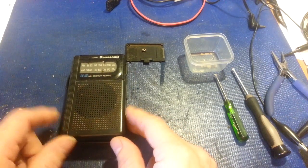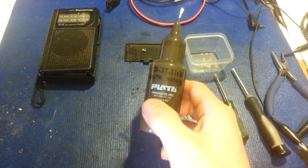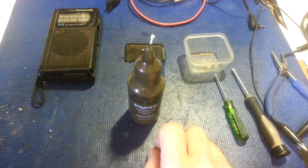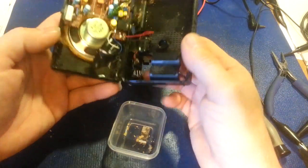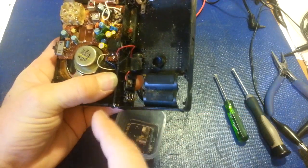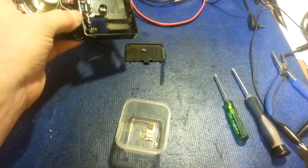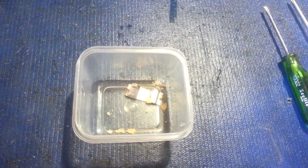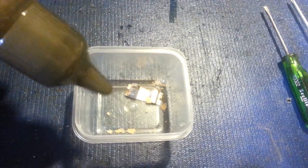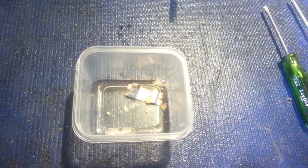Most kitchens are going to have vinegar. I use distilled white vinegar — I keep it in these little bottles as my bench bottle, just for stuff like this. A lot of people wonder why I have vinegar on my electronics bench — that's exactly why. Here's the contact strip; luckily it only leaked out on one side. The terminals on the side with the positive and negative connections are fine. It was just the little strip connecting the two batteries in series, which I pulled out with pliers. You can see all that white crud — that's the material that leaked out of the battery.